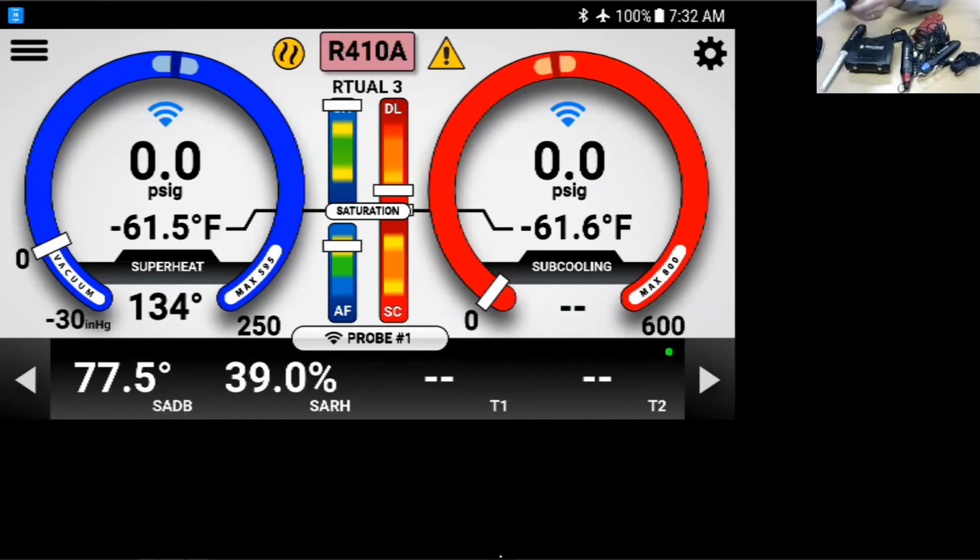There are little magnets here you can see, and one of the things that Nick has there is the repeater, which can, again, strengthen the network and give you added range to the different probes that we have here. We do also have the dual input manometer, which can populate the static pressure into the app to help calculate airflow and static pressure. There's a lot of different options for things that can be added to this setup that I have here. It's not limited to just what we have here. And the more that we can add to it, and the more information that we can generate in the app, the more accurate our data will be.